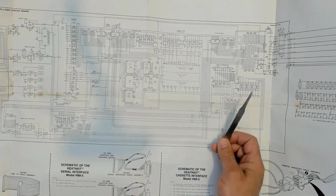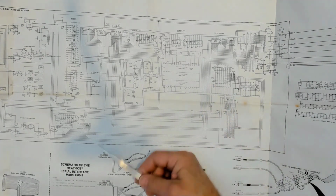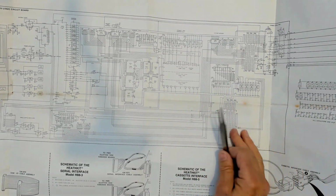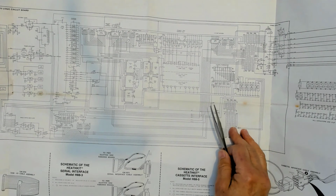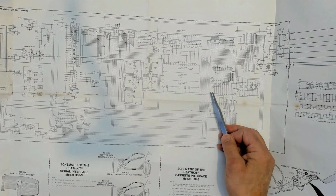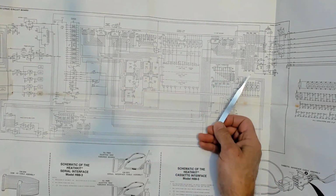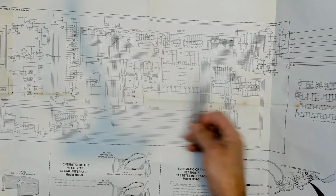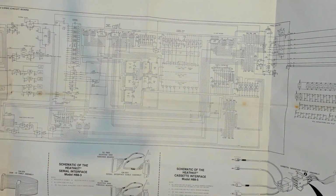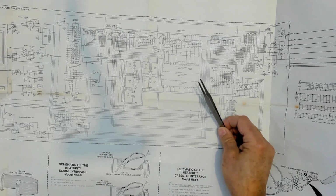So anyway, I went through all the schematics I had for the H89, the H19, and any little clocks or other little kits that I've put together. And maybe somebody else has put together more Heathkits than I have, and they remember some of these override control points, but I couldn't find them anywhere in any of my Heathkits. So I was really surprised that Heathkit didn't have some of these built-in fixed input pull-up resistors, to allow you to set and reset latches or counters or anything like that. So maybe somebody else has some examples of where they can find those in Heathkit.